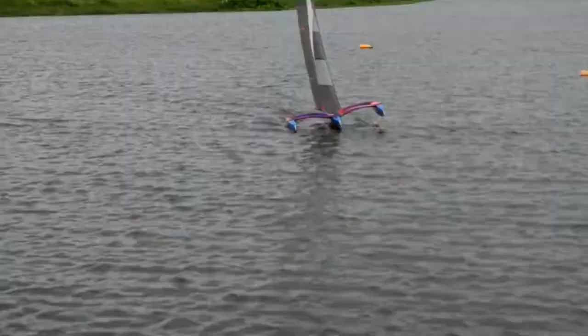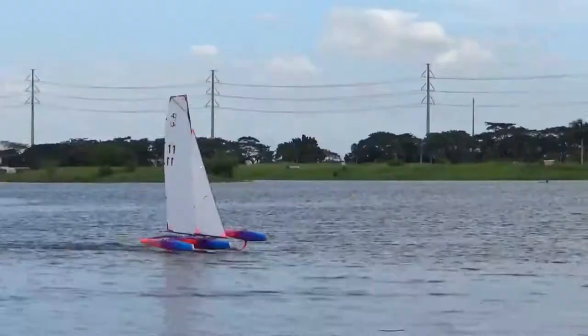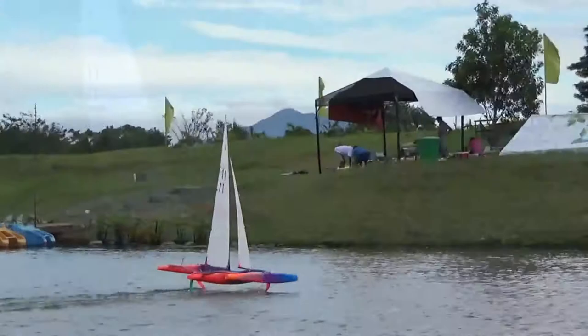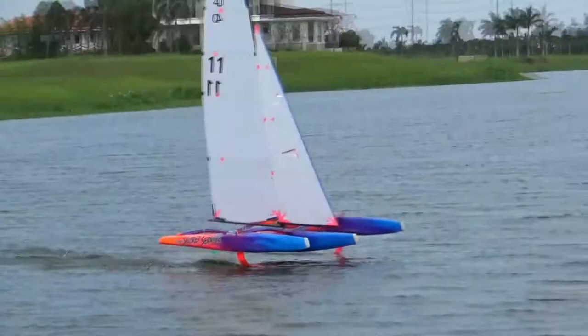The downside to this concept is it's only giving lift, and unlike on full-size boats with crews on board who can manually adjust the foils, we cannot create neutral or negative lift from the windward foil to give us more power when sailing upwind. I've also started to make my own sails, and I'm experimenting with lower aspect ratio rigs. Whilst not as efficient as taller, narrower rigs, they have the advantage of a lower centre of area, which helps with the stability of the boat.